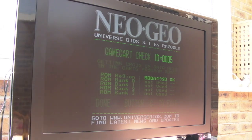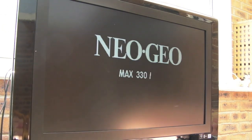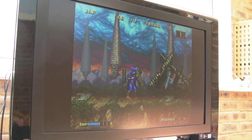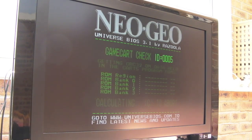I'm just going to go and wire up that pin now to +5 instead of ground. Right, so I'm connected to +5 now, A18. So as you can see, game's working again. This time, look, we get an intro. So there you go. It is actually working. We'll do the checksum. Different HP bar. Looks like we've got more health slots there as well. Very interesting. So CRC check. Now hopefully this will be a different CRC to previous, and it's okay. So there you go.